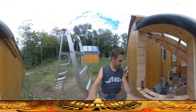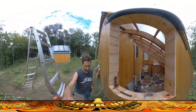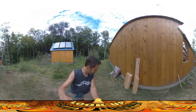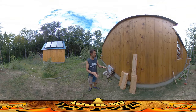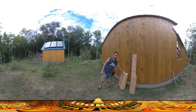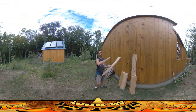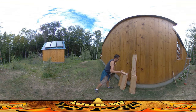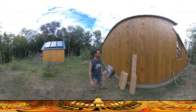As soon as I get that piece of trim on here, I'm going to take the screen, put it back down, screw it in place, and this section is done until I get the louvered bits put together. I was able to calculate how many louvers I'm going to need in total. There's going to be one louver every three inches, so each side needs 17 louvers. From each one of these boards I can get two louvers, so I need 17 of these pieces of scrap board.